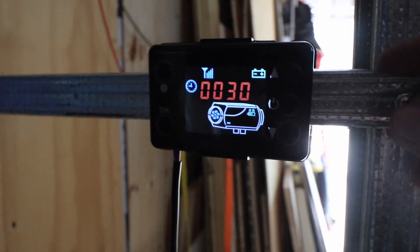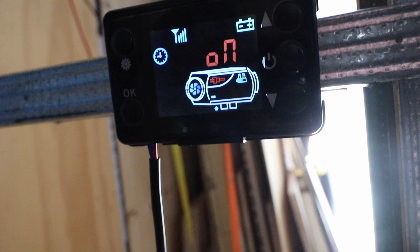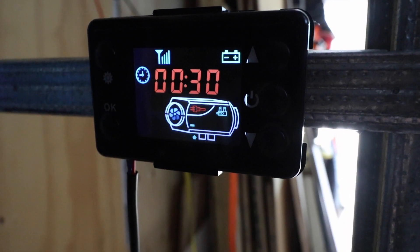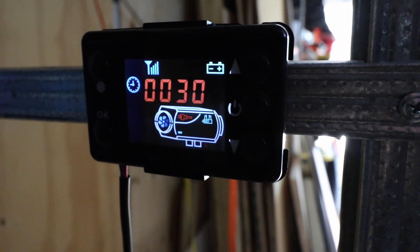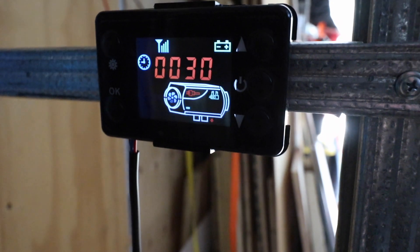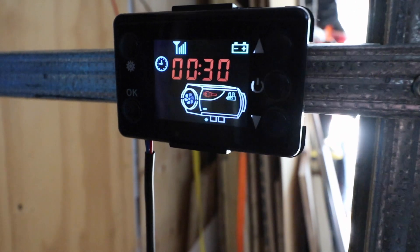Moment of truth. I think I've got all the fuel air bubbles out and everything primed and ready to go. Let's see if this thing works. I think it's just the power button here. It says on and everything sounds normal starting up. Display looks good. Just hear the fan going down there. Let's see if the thing ignites — that red glowy thing in the center is the glow plug in the chamber. As soon as the fuel starts going in there it should ignite and start giving me hot air.